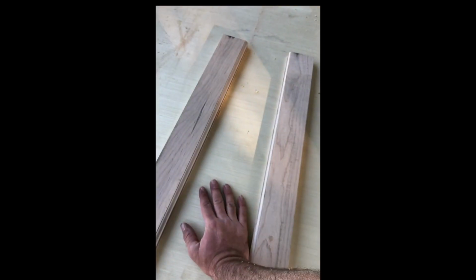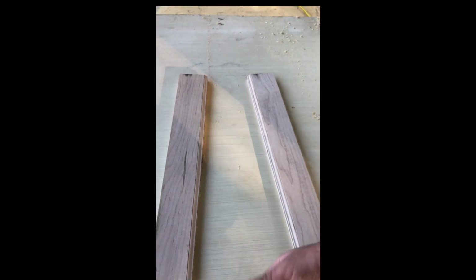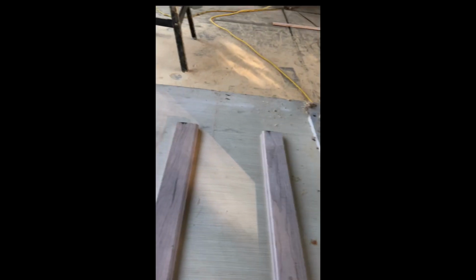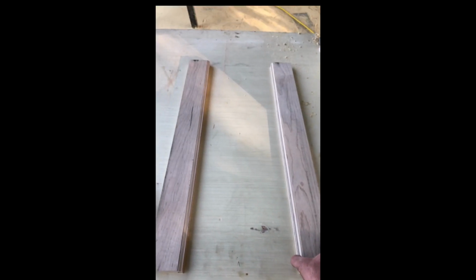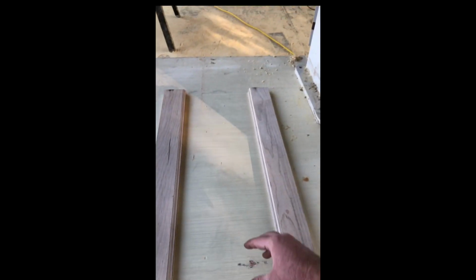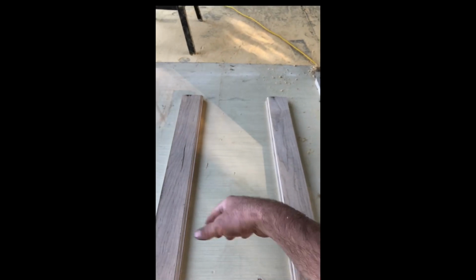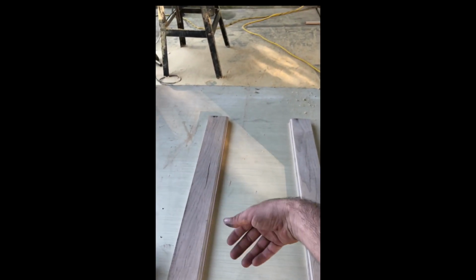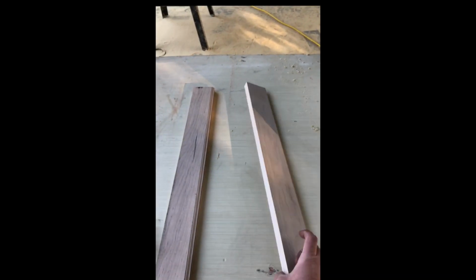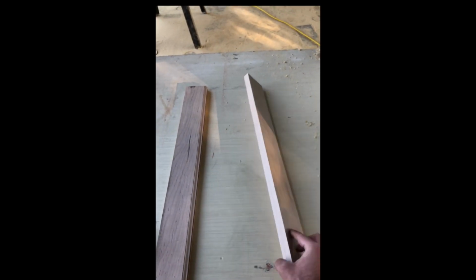These doors, usually we would cut a raised panel that somewhat looks exactly like the drawer fronts wherever they at. And it would lock in here, and we flip it, glue it, nail it, and clamp it, and all that cool stuff, which I'm sure we'll have a video to show y'all on the next job when we have those to do. But this one's gonna have glass. So we're only gonna temporarily cut all these pieces. We're not gonna put them together. We're just gonna test them, get some glass cut, install that, and then we'll show y'all how we dado our little grooves for our hinges and everything. So y'all stay tuned for that.